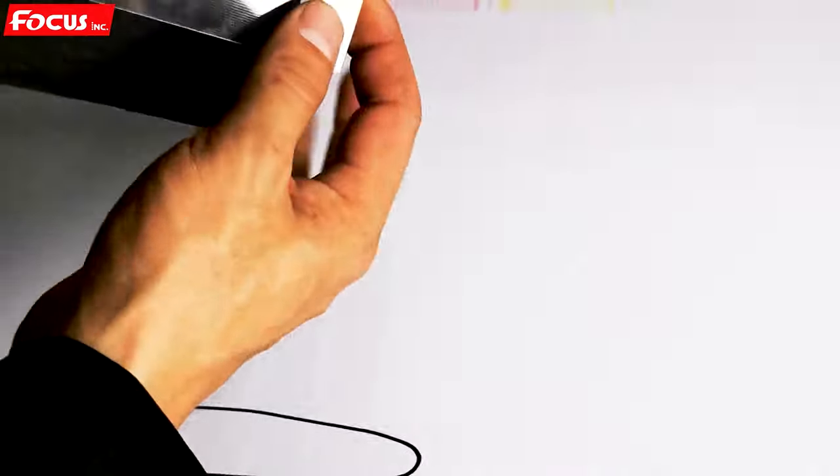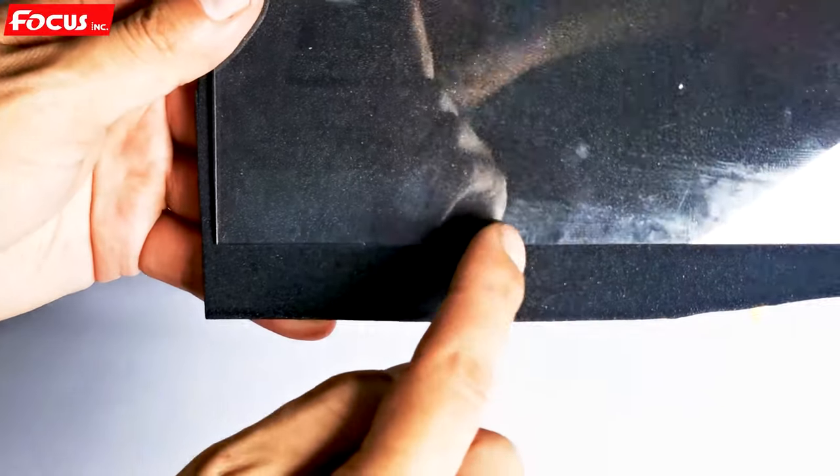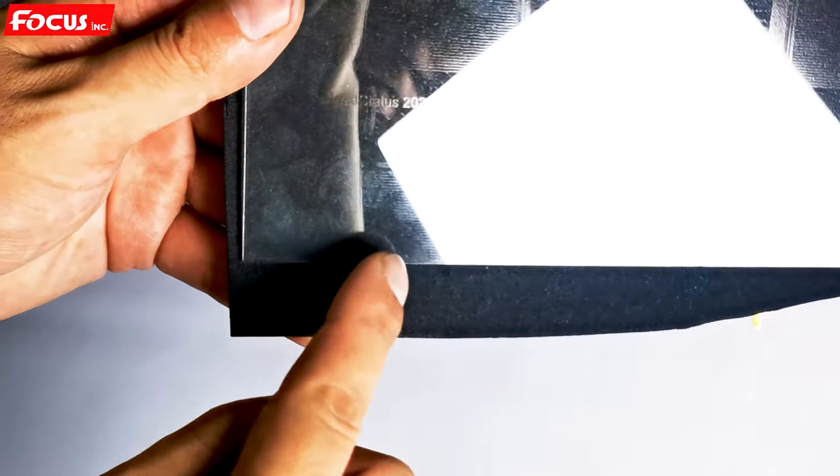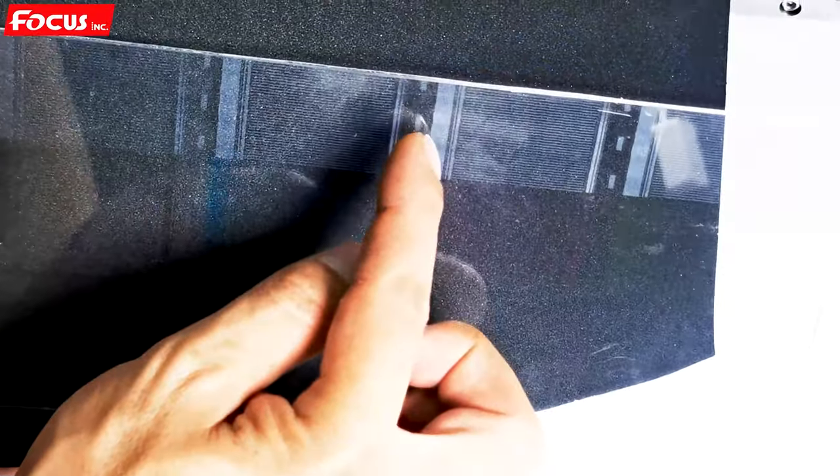The color channels you can only see on the table or printed out. Then we look at the varnish — because varnish is transparent, it is harder to see. But we can confirm the varnish is printed out as small lines. So we have varnish nozzle check, color nozzle check, and white nozzle check — all printed out.